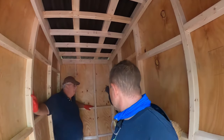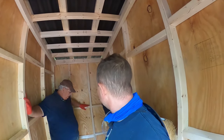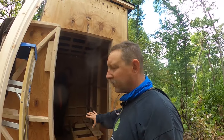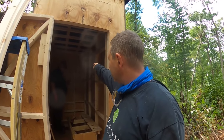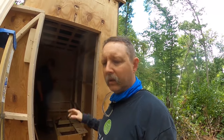Then we're going to cut a hole right in there. Pipe will go up, out 90 that way, and then over and on the other side on the back wall we'll come out somewhere in here. That's next. So what we're going to do, go ahead, put the box in, get it all set up and done, put the PVC through, then put another piece of PVC, make a mark, use our circle cutter, cut another hole, and on and on.